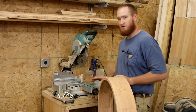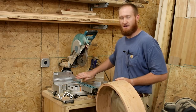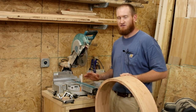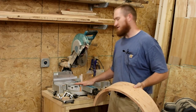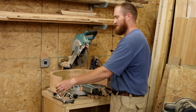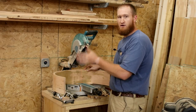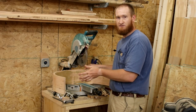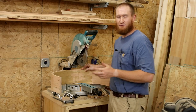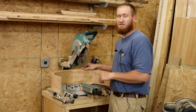Here's what I decided for this project: I'm going to use my chop saw or sliding saw. One of the primary reasons why? Lasers. Pretty much all saws nowadays have some type of laser on them, and it helps you line up your piece really quick. Also, this has a nice flat surface — that's what I need to make this cut. I'll line up the laser and get a nice, perfectly straight cut every time. I'm going to get within the vicinity of where I need to be, and then come in with some hand tools — chisels and files — and work my way up to where these pieces fit together perfectly, so I won't have to fill gaps with glue or epoxy.